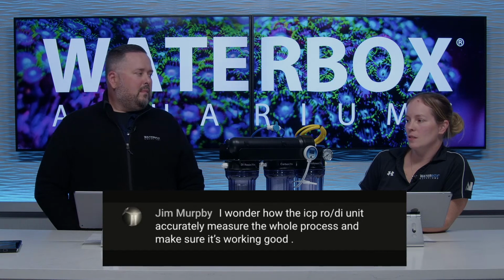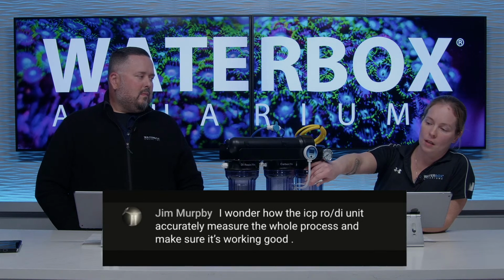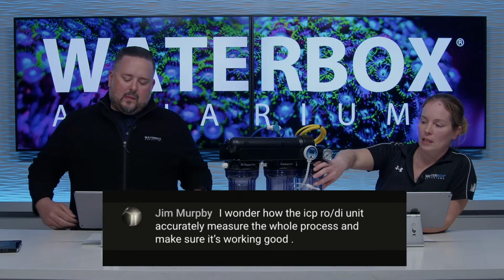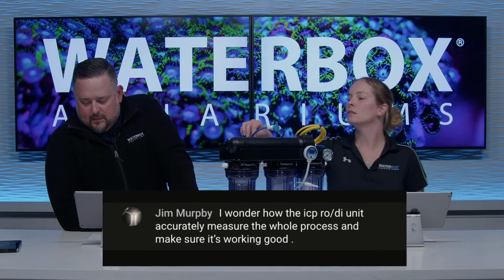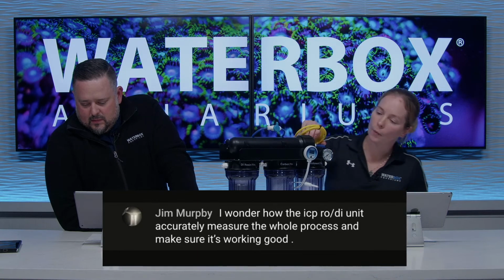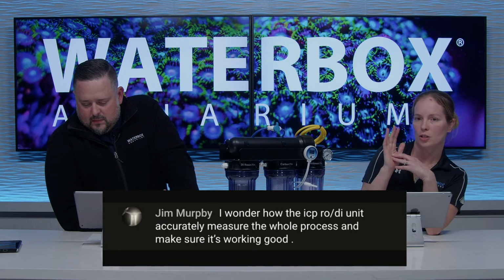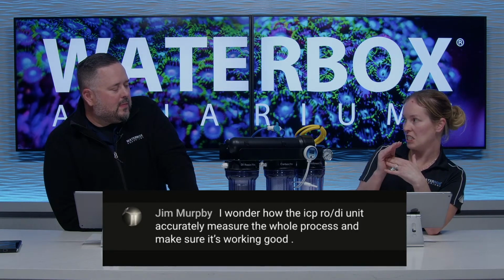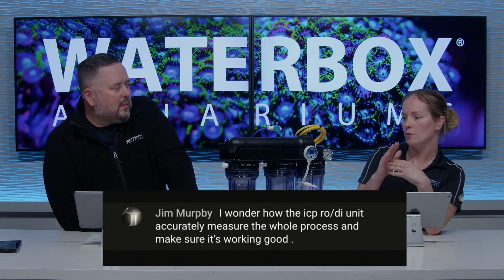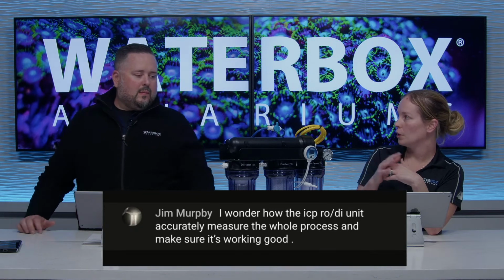I mean, your TDS is pretty standard. The good thing about an inline TDS is that it goes into a connection that's running through the line. So it doesn't really have any exterior influences on it, because it's just into the T, and those prongs are where the water goes through. I imagine, if your unit's older, take those out and clean around them with a Q-tip.